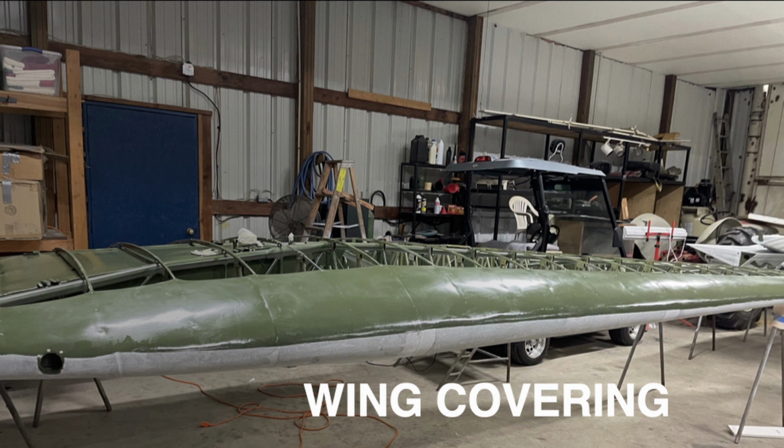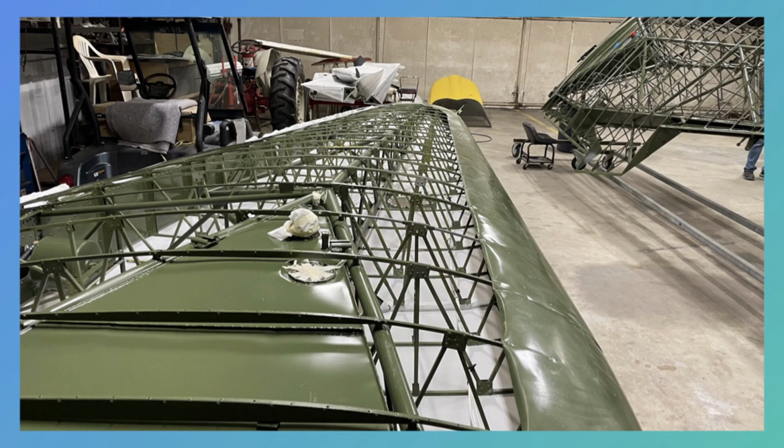And so you can kind of see here the widest part of this wing, they're about this wide. So I mean they're pretty thick. Compound curves everywhere. They taper thick and then they go thin. So that had the heat treated spar. I know some of the earlier ones had spar failures, center section. So the SRs, to my knowledge, were the only wings that were heat treated.